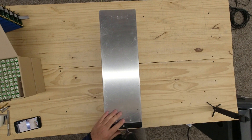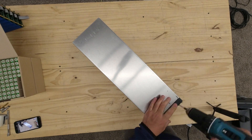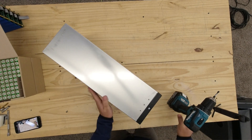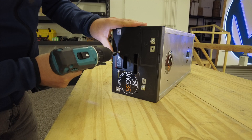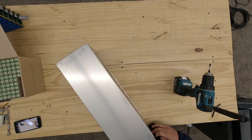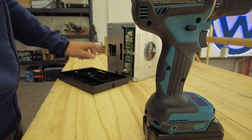So let's start the process. The first thing you got to do is take off the front black plastic. You take the two screws from the edges, then the two from the front. Then we pull that off — but that one has a cable, so you can't completely take it off because it's tethered.